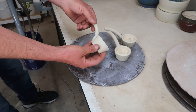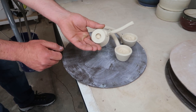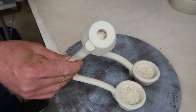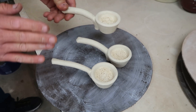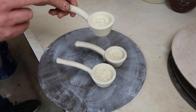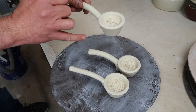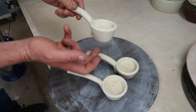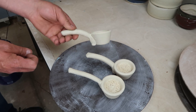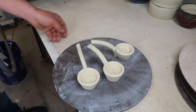So these are out of the kiln. And I've got to tell you, just looking at them, I wonder — are they really going to let metal flow through them? I'm very interested to know. I'm not going to preheat it, at least not the first one. I could put a torch to it and try to warm them up, but will it break? Most likely it's either going to crack, or the metal is just going to puddle and not go through. Or worse, the metal will start to go through and then freeze inside the sponge. In which case, I'll break it with a hammer and we'll take a look. But let's take these over to the furnace on the back porch and try pouring metal through one of them, and let's just see what happens.